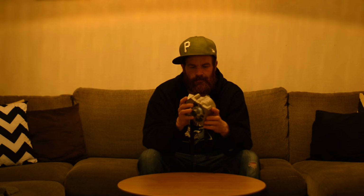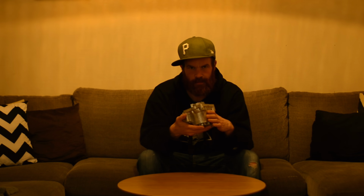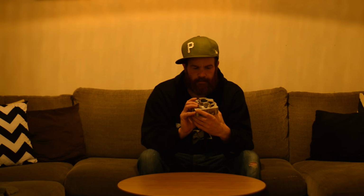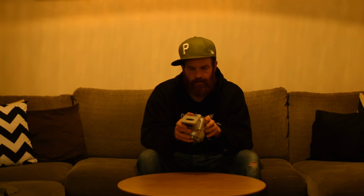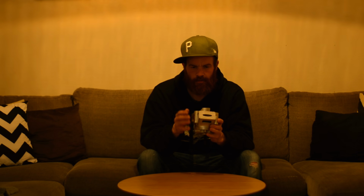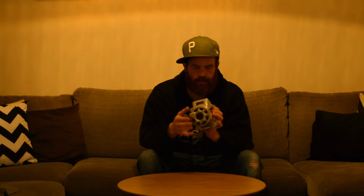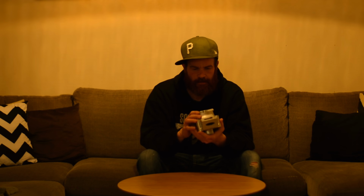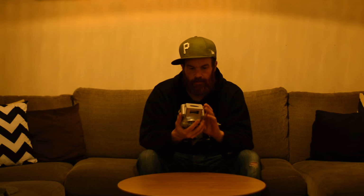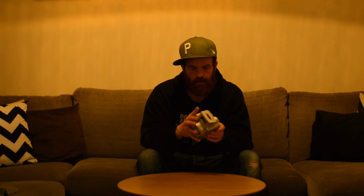The fifth one is a winner, I think. I've removed the sprue and the riser, and I've dug out all the gypsum or plaster. Apart from some flaws here and there, all of them seem to be caused by either parts of the mold falling into the mold, or plaster penetrating the layers in the 3D print. But all these flaws are in places which are easy to fix by welding or just grinding them out.